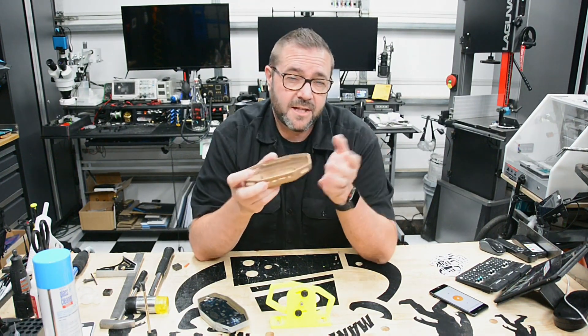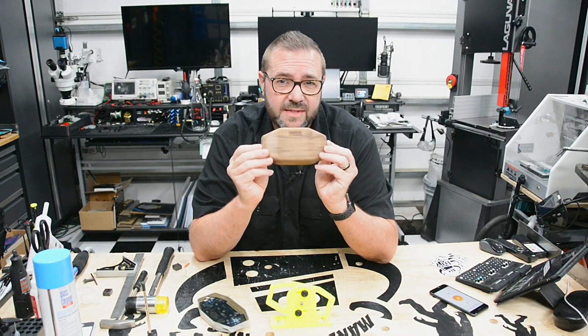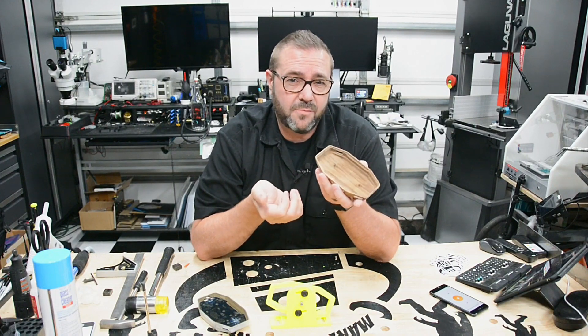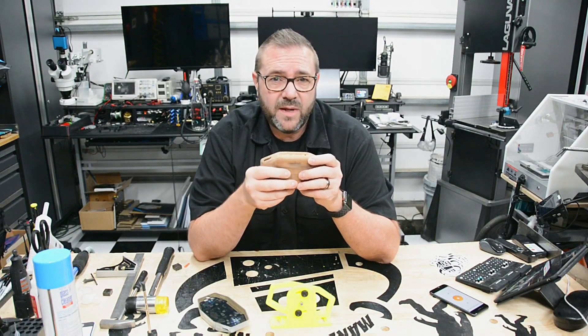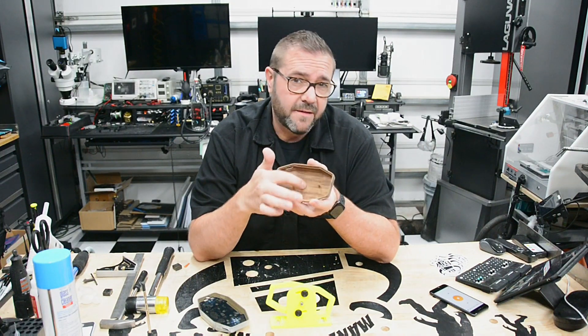It's actually easier than you think. Looking at the Arcader body that we milled out in a two-sided operation, it was easy because we created a fixture — just a simple pocket jig — to hold the stock in place. In this case things are a little more complex, and we need to hold the body in several different angles.